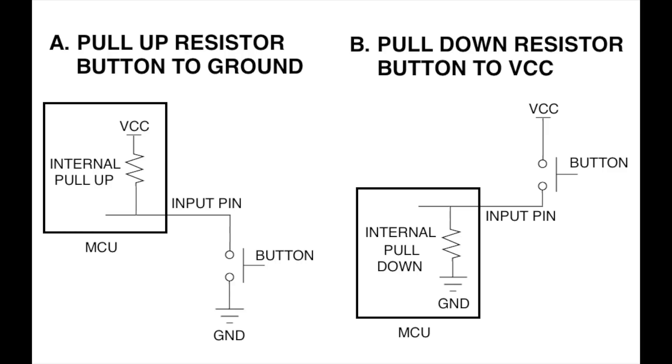If you look at the demo code for this box, in the setup function you'll see a pinMode call for each of K1 through K4 and the Z button, all set to INPUT_PULLUP — as shown in image A. The resistor is actually used inside the chip, and the only external component is the actual button on the little red game controller. Hopefully that adds clarity to how these buttons work — even though there isn't an external resistor, the resistor is just inside the chip, but we have to tell the chip to turn it on.